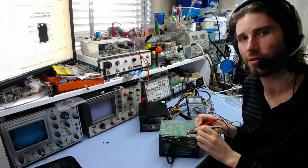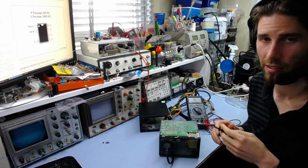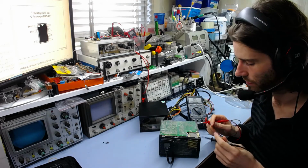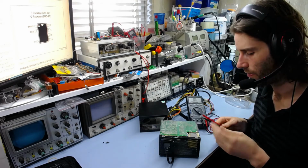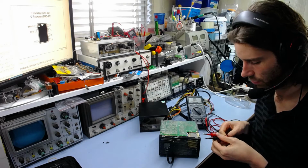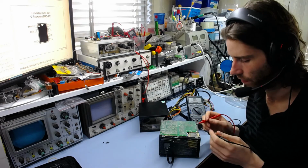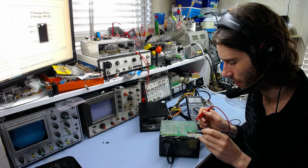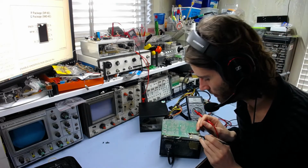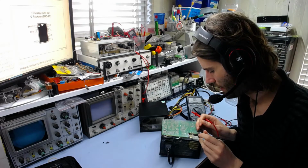It's usually the high value startup resistors, for trickle charging startup caps in other types of circuits, that fail by themselves without any overload. Just high value, high voltage. They see high voltage and they just fail eventually sometimes. But this one, low value, it shouldn't fail, but it could have. I'm thinking maybe that chip has failed. Again, it doesn't look blown up, but hey, who knows?